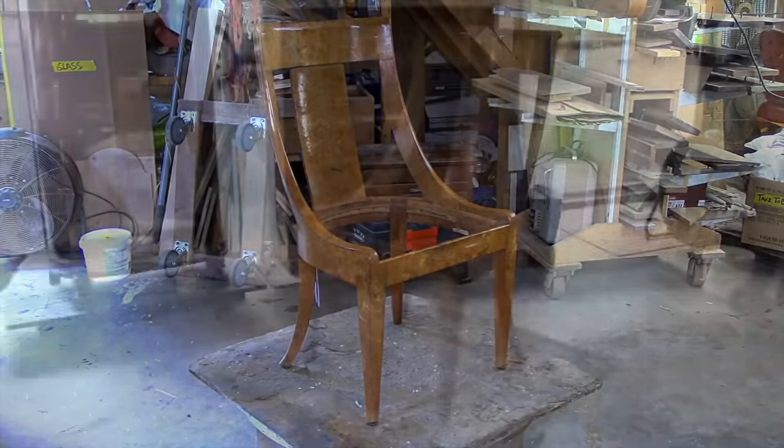All right, the gray pad really evened it out. It looks good now. I know I cut through in a couple of places, but not too many. So now I'll wash it off with the wax wash again. By the way, it took me about maybe 45 minutes to sand this and get it all ready. I still have to do the leaves, but they're not nearly as bad as this top. This top, the leaves look great. I mean, they're not perfect, but they're a lot better.